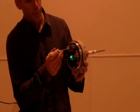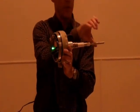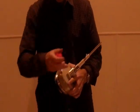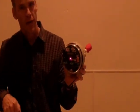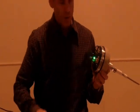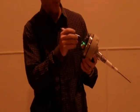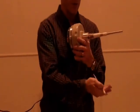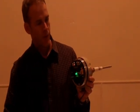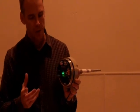There are four levels of calibration via push button. We're going to choose which level — right now it's set at sensitivity level one. I don't have to touch this probe to change the state. I can put our sample of Play-Doh on here, it's going to stay red showing material present. If I remove it, it goes back to the previous state. So when we calibrate, we choose one of four sensitivity levels. I'm going to change to sensitivity level four. All I have to do is make sure the material is eight inches or more below the probe, then push calibrate. Within five seconds, the unit's calibrated. You don't have to add material to the unit.